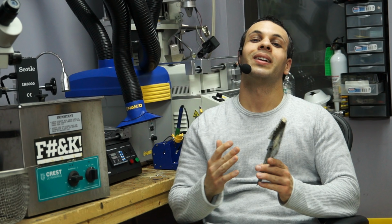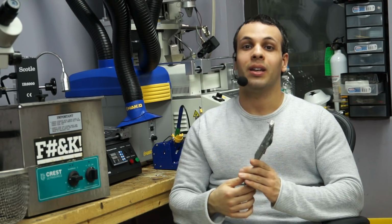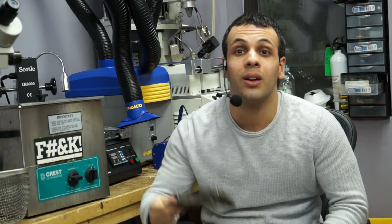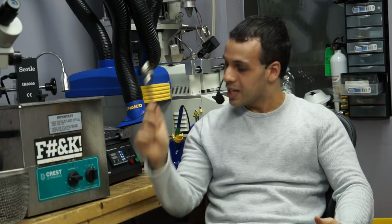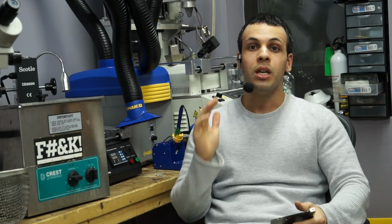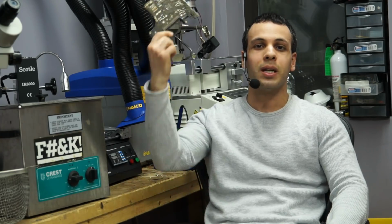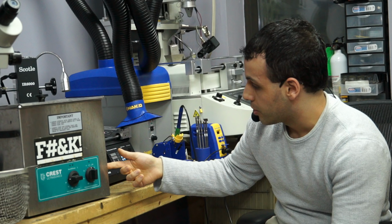And again, there are so many people where I tell you over and over and over, and you just ignore everything I have to say and fill this up with Windex or dish soap. Seriously, I've read blogs and seen videos where people are using dish soap in this machine. What is wrong with you? You use dish soap on dishes. You don't use dish soap on a $500 motherboard that you're putting into an ultrasonic cleaner. So let me show you how this thing is supposed to work.